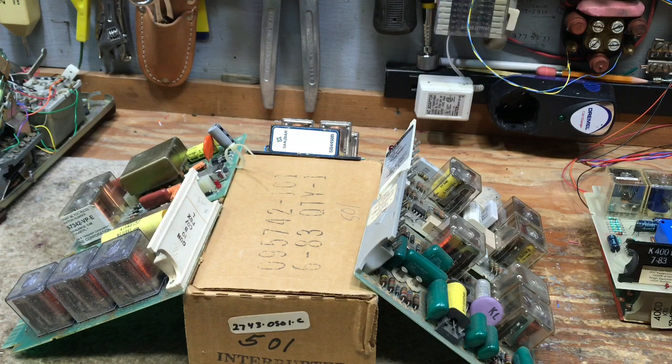The 5 cards that are in the video at this moment: we have a Northern Electric KTU. They call it a QUN10. This is equivalent to a 400D, for an example, KTU, which is made by Bell Canada. Then the next one we have is an ITT 400 TPL, and the TPL stands for Total Protected Line. This particular KTU was used by interconnect companies that did not have an ITT certification on file with the local telephone company. So you could use this instead of a conventional ITT line card. They sucked, but that was something available.